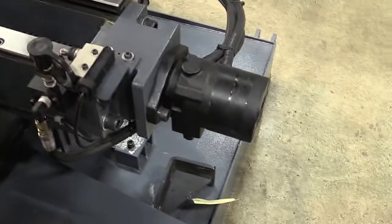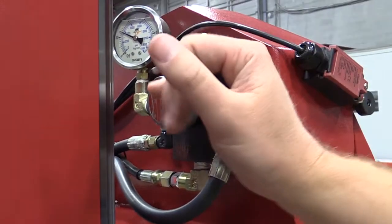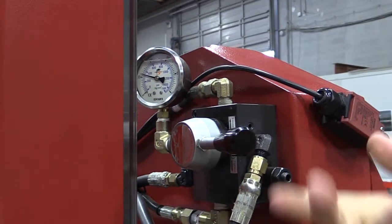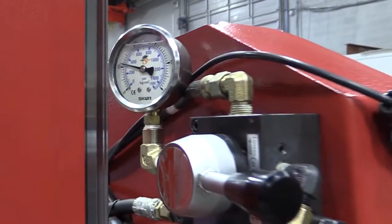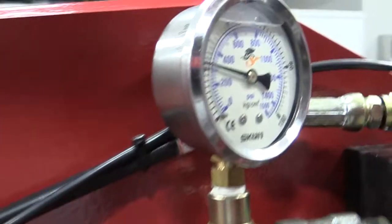Hydraulically driven, screw-driven power vise. And just a hydraulic blade tensioning — loosen, tighten, it's that simple. Pop it right in the middle and you're ready to go. So it's very simple to do a blade change on this bandsaw, and you also get the right tension for your bandsaw blade with this system.